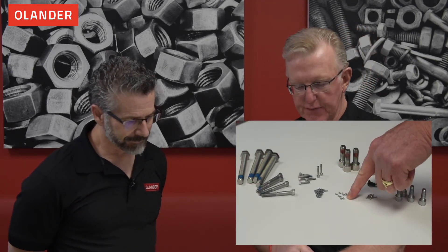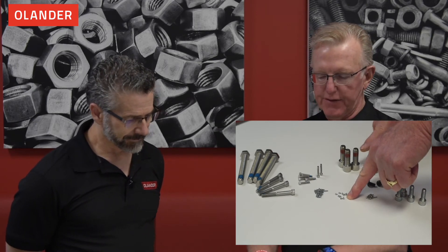As you see here, we have some very tiny screws from a metric 1.6 up to 3/4-16 bolts. There is no real limit to what size you can do. The costs vary, of course, by how hard it is to apply the patch or the microspheres to the part itself. It can go on nuts, it can go on bolts, and this doesn't have to just be a fastener — this can also be put on NPT pipe threads and things of that nature.